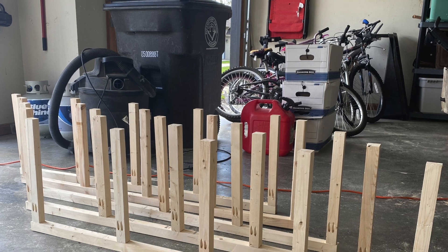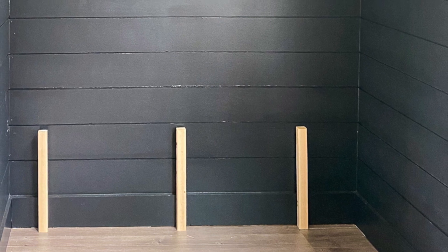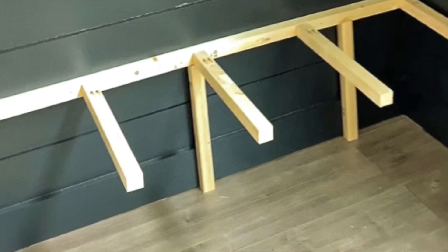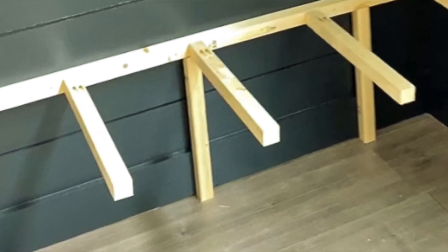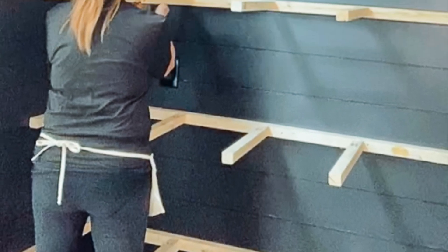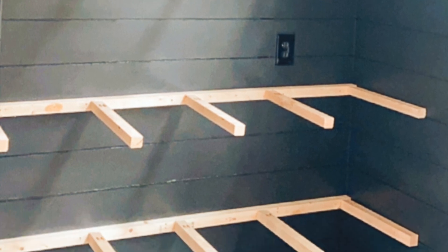You'll only have one of these if you're making one floating shelf. However, I was making five floating shelves for next to my fireplace. If you're hanging multiple shelves, you're going to want to figure out the spacing between each shelf. I found it easiest to cut scrap wood and use them as spacers so that I didn't have to fight against gravity. Using your spacers to set the support, work your way up the wall. Attach each support with two and a half inch wood screws into the wall studs, and use a level to ensure each support is straight. Here's a look at all five shelf supports attached and ready for plywood to be wrapped around them.